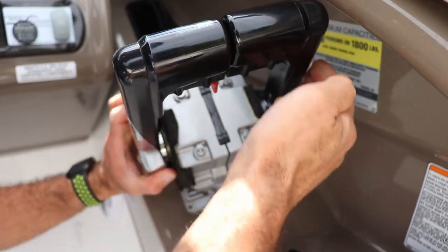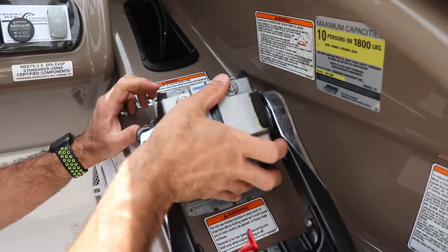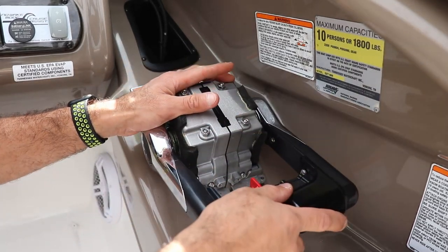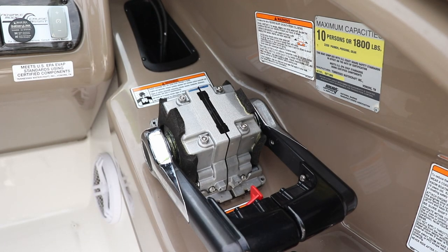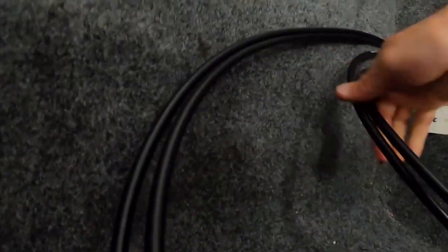If you find that you're having a hard time getting it in, you can try pushing this — just like we had gotten it out — and try giving it just a little push. If it's not dropping into the hole, your cables might be binding up. Go underneath your helm and look at the control cables there, and give them a tug back and forth a little bit. That'll free them up from binding against the sides.